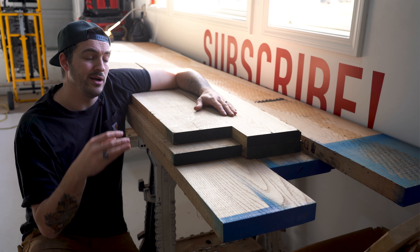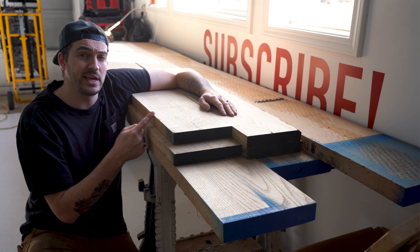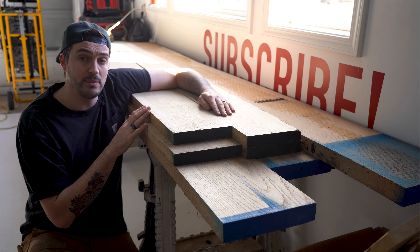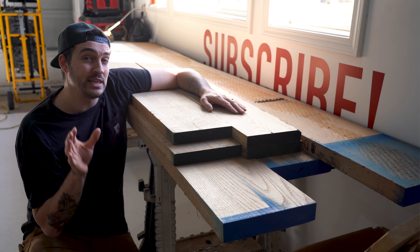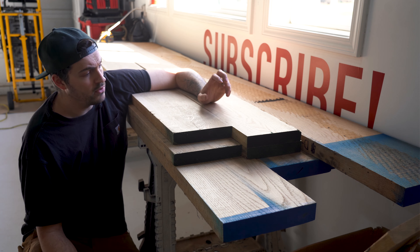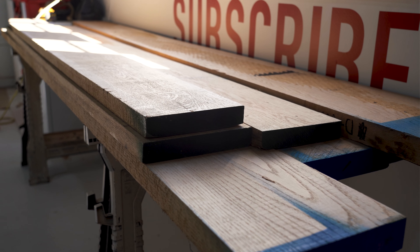It's all going to be made out of the same material, one and a quarter inches in thickness. Most of the A-frame and all of the support pieces are two and a half inches wide, and obviously the top is a lot wider but we'll get into that later on. For the material I picked up this six quarter inch and a half thick white oak — the same material I used to build the bed we just made. As you can see, this material is pretty rough and it's oversized.